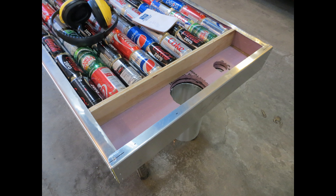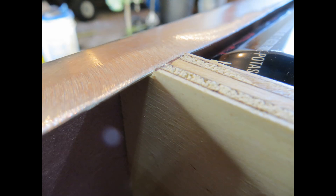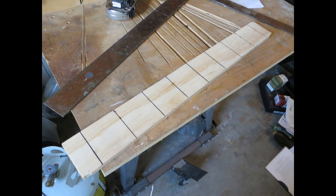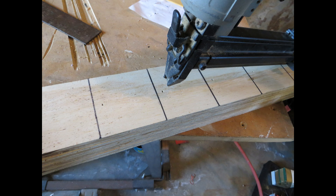The intake and exhaust manifolds need to ensure that all air travels through the interior of the cans. Therefore it is important to have a good seal to each can. This also means the manifold itself needs to seal well against the interior of the heat box as well as the plexiglass when installed later. I used the drill press to cut the holes through the manifold, layering four sheets of half-inch plywood on top of each other to cut as many holes as possible at once for the four manifolds needed — two per solar air heater. I used a brad nailer to assist in keeping the sheets together and aligned during the drilling process.